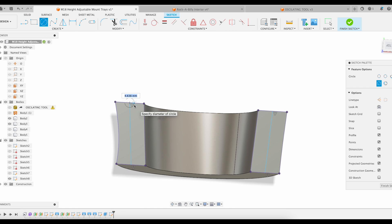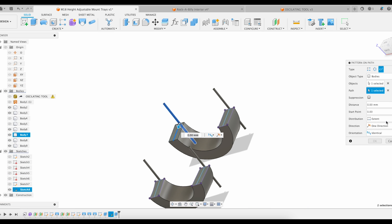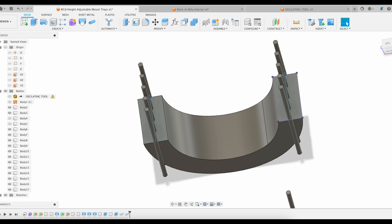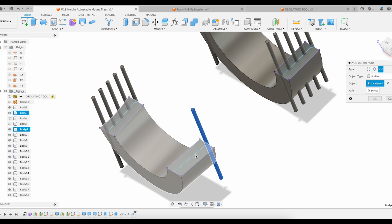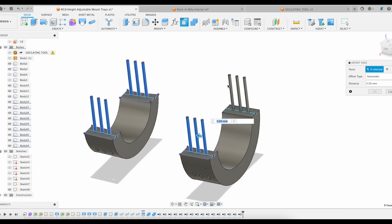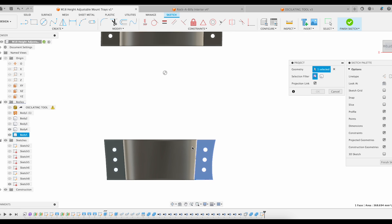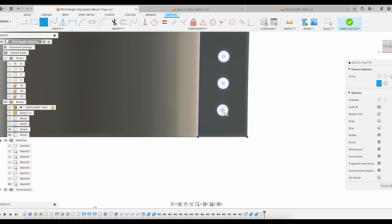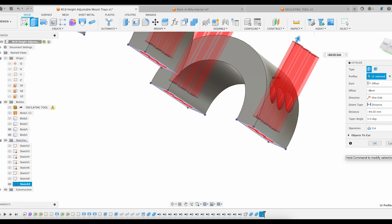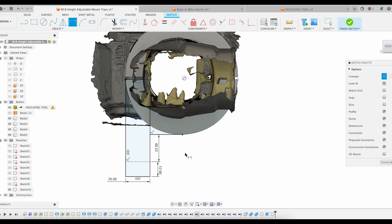Now I need a way to connect the two halves over top of the tool, so I just did a pattern along path. There are a million ways you could do this operation - it's all up to personal preference. I did a 2.6 millimeter tube or pipe, and that's what I'm going to use to do a subtract from the main base. I upsized the upper portion to 3.5 millimeters to give me the pass-through. Then I used another circle to create the counter bores to hide the screw heads inside the other half, offset the starting point by about six millimeters to give me that strength for the actual screw head to clamp against.